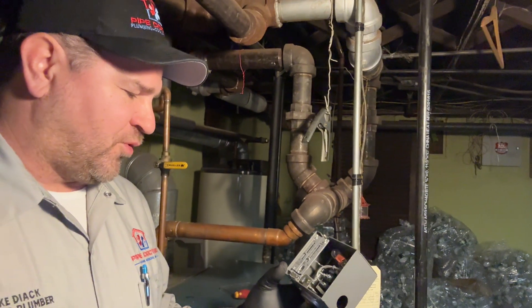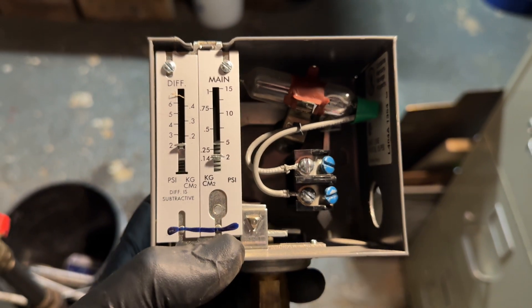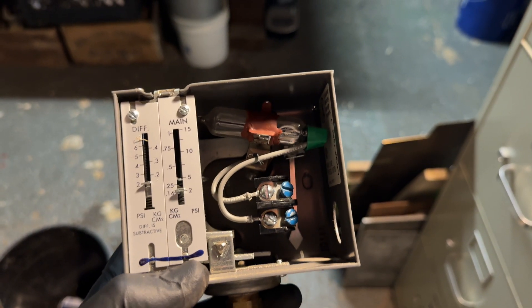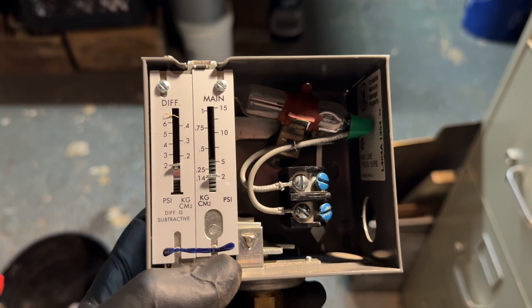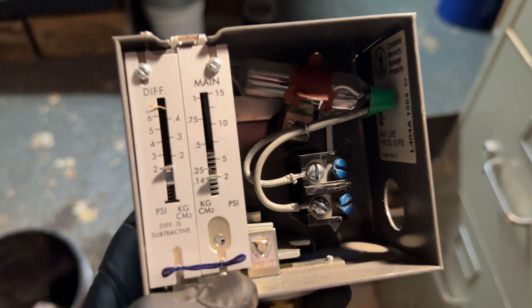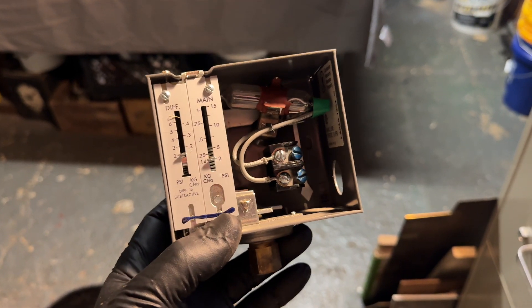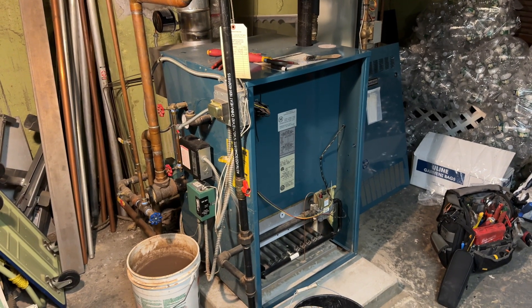The issue with these is that they usually show a start point of 2 PSI. We definitely don't want the main set point to be anything over 2, because anything over that will result in overproduced steam — which is wasteful in terms of fuel energy, whether it's oil or gas. I've seen many pressuretrols set well over 2, even 5, 5.5, 7, 7.5. A lot of plumbers can be great at laying pipe and installing systems, but when it comes to properly commissioning and maintaining a steam system, they just don't have the experience or know-how.